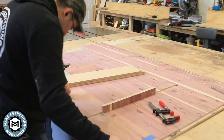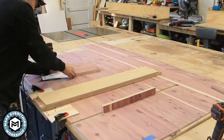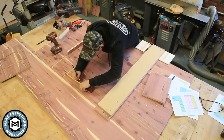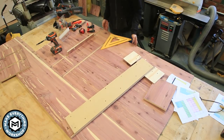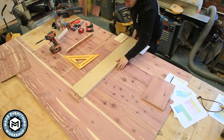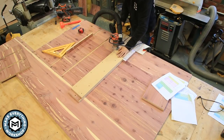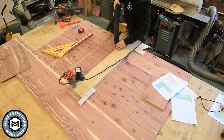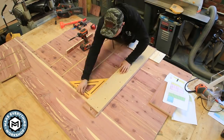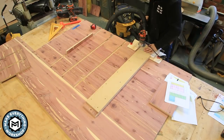If you make one mistake when cutting shelf rabbets, you lose your side panels, which take up the most material. The three-quarter inch veneer plywood costs about $150 a sheet, so one mistake is a $150 mistake. With this setup though I was able to quickly measure off the previous shelf using the guide - checking everything is square - and rip both side panels at the same time, which is another way to avoid errors and ensures everything lines up and is square when assembled.